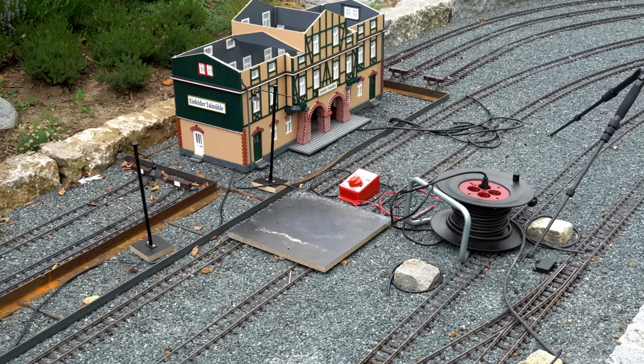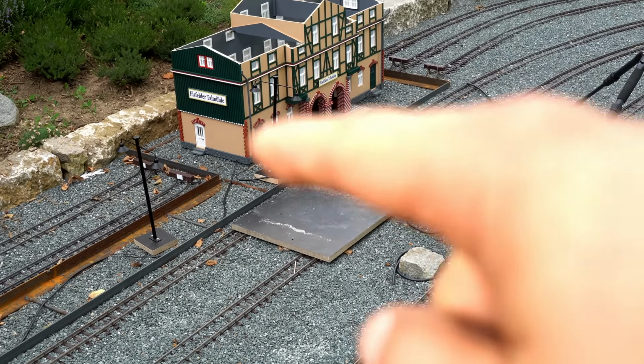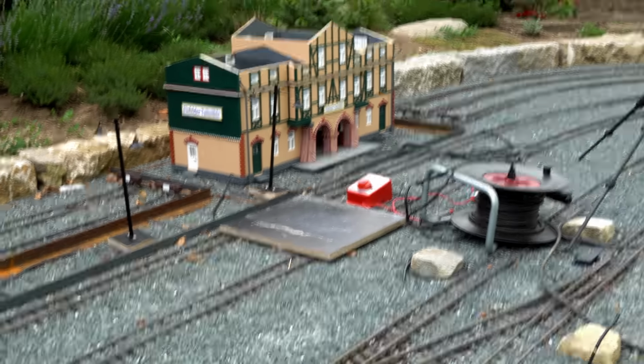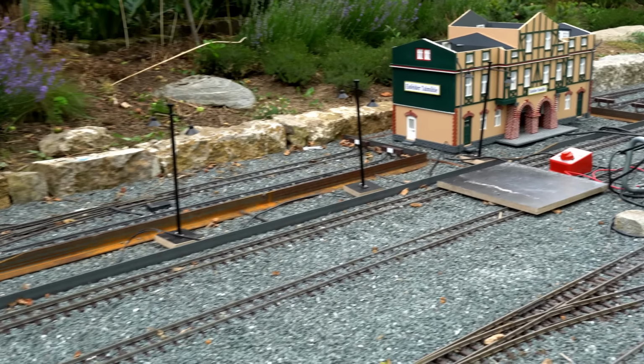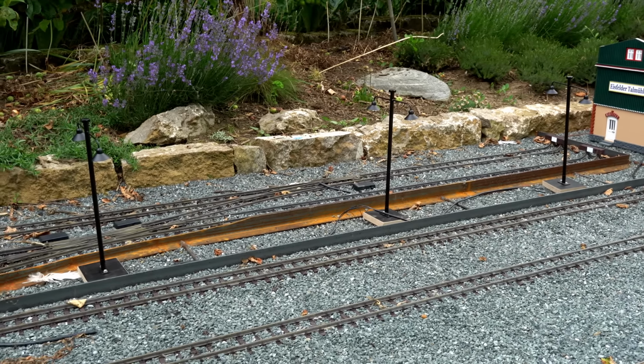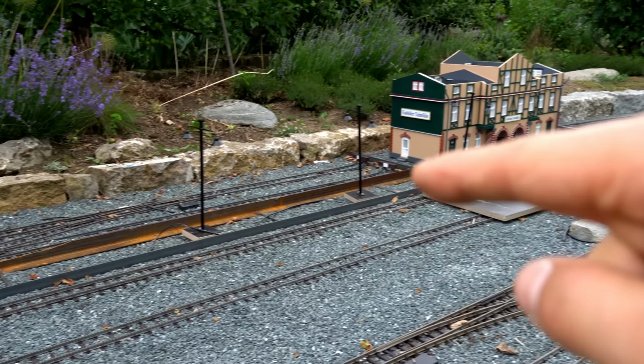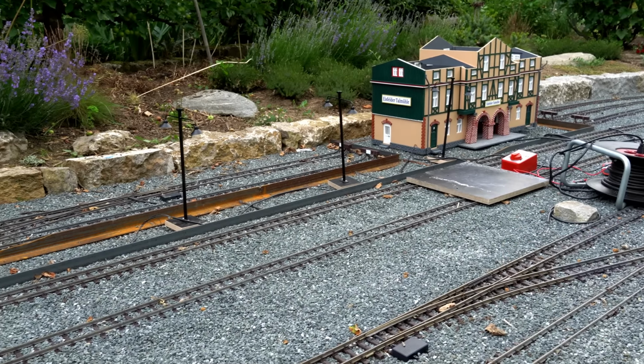Here's the deal, guys. I've tried to test the lanterns with this little power supply right here, and whilst testing I've noticed no lantern would light up. Then I've switched my multimeter to measuring amps, and I've discovered I have a short somewhere from here to there. Now I am forced to cut each wire between the lanterns to localize the short.